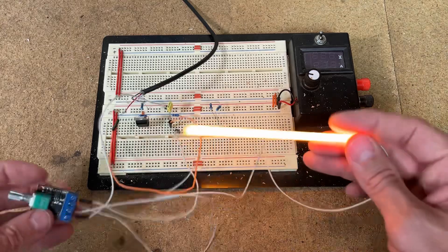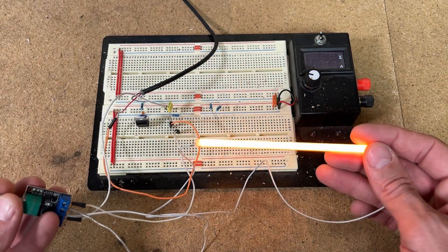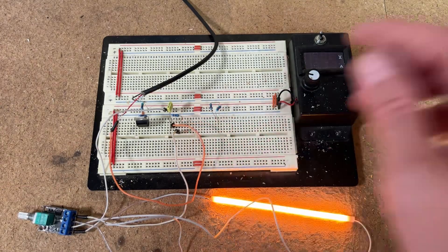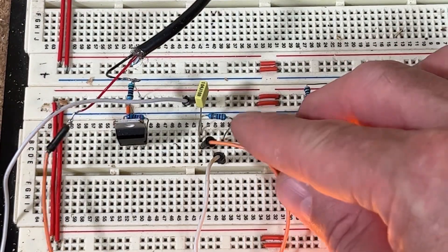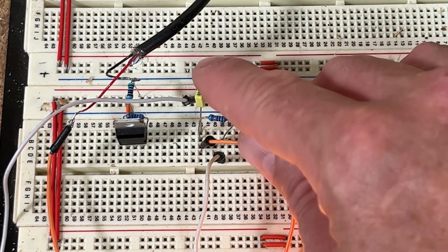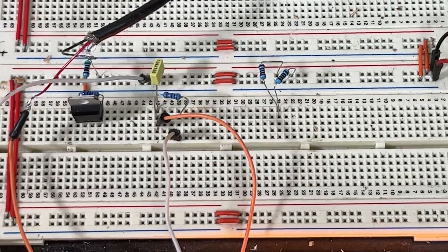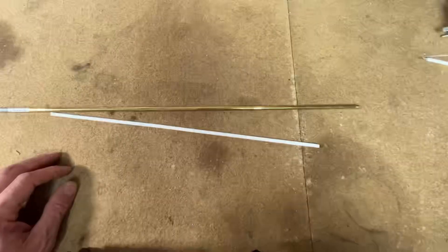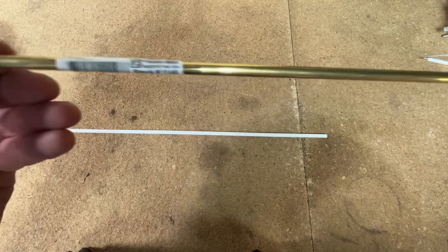You can see it's a nice dim light as well. I've added a little resistor - it's a 10 ohm resistor - and just a small cap to help buffer some of that power and make it a bit smoother.